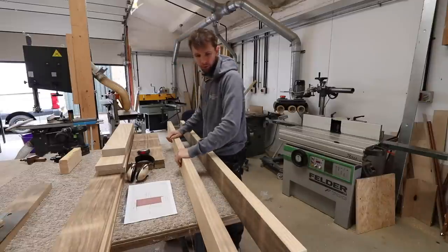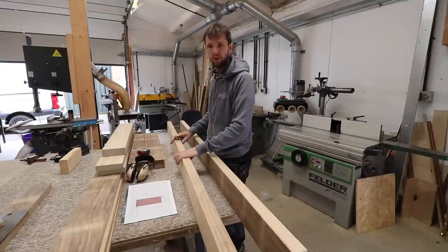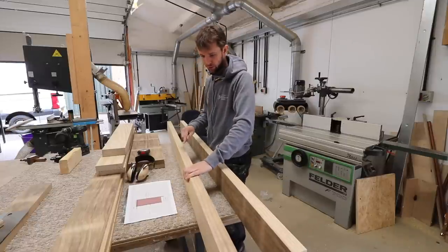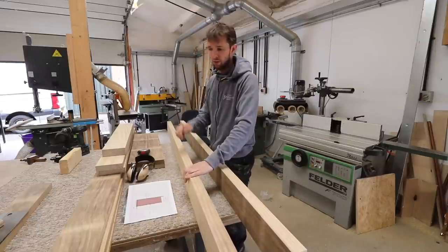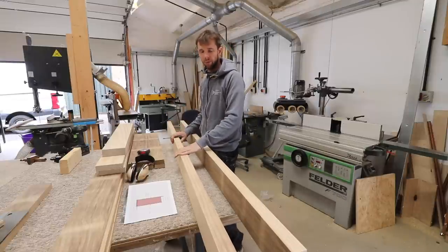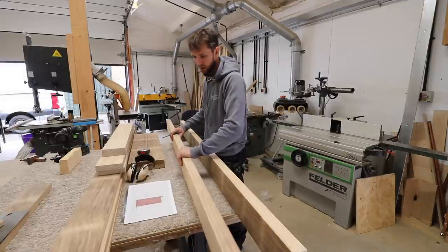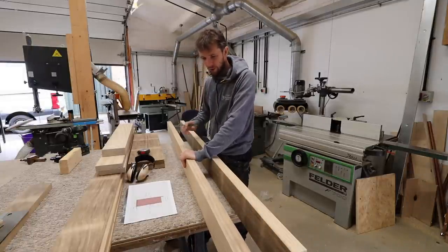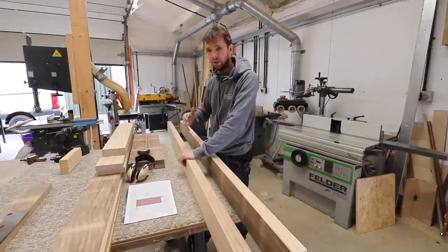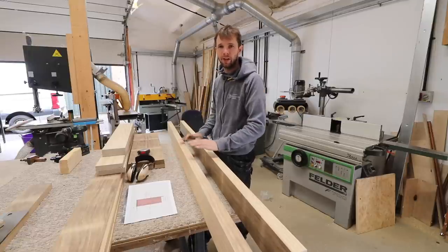I ran you through the manufacturing method that I used for this door at the start of the video in the SketchUp drawing. So we use a groove in the side of the stile that the boarding will sit into, and we've worked all them widths out from that drawing. In terms of face mark positioning, I think I mentioned it in the video, but I used the back of the door as the face mark, so the side of the door that has the braces on it, that's the face for when I'm machining this door.